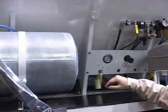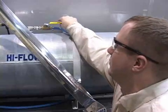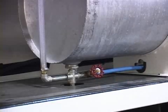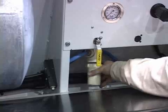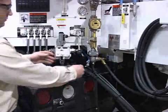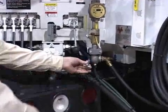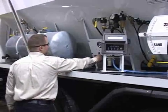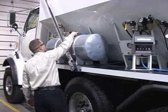Zimmerman Industries recommends that you follow these simple steps. Shut off the air supply to each admixture tank by closing the ball valve. Once you have closed this valve, open the dump ball valve to release the compressed air from the tank. Shut off the valve at the bottom of each admixture tank and remove the strainer and drain tank. Open drain cocks on each admixture circuit. The first is located at the rear of the operator's panel and on top of the flow meters. The second is located at the end of the hose that comes out below the water flow meter. Water or pressurized air can be used to flush out lines and flow meters.